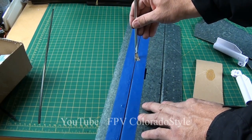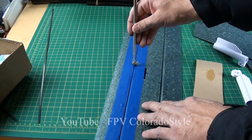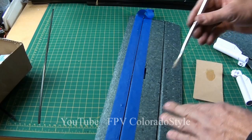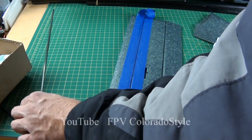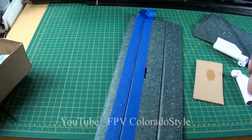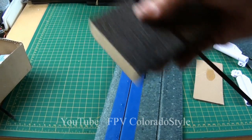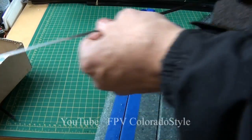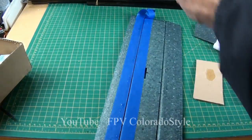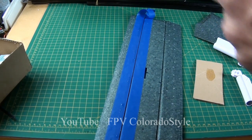You might want to trim back the tape before you do it — I had kind of pre-done that before you saw this, looked off camera at where I needed it. Now we're going to sand the spar. If you don't sand carbon fiber, it does not stick very well. I'm roughing it up with about 100 grit sandpaper, 80 or 100, with my block here. When I'm done, wipe that off with a cloth — cloth would be more preferable so there's no oil on it.